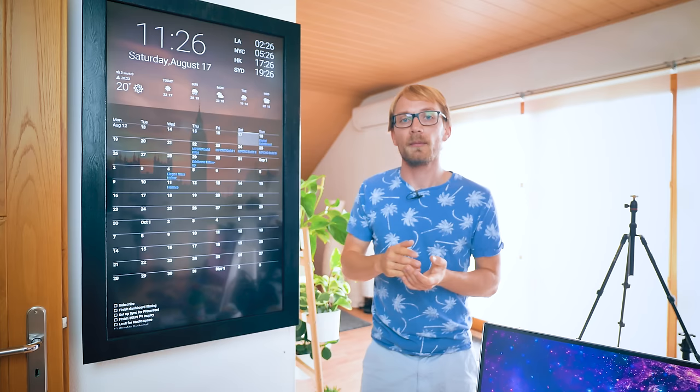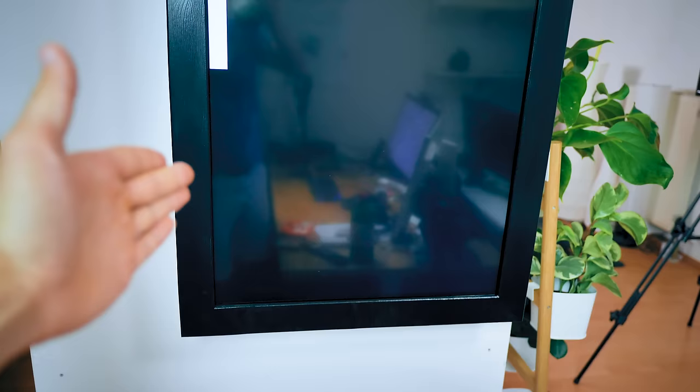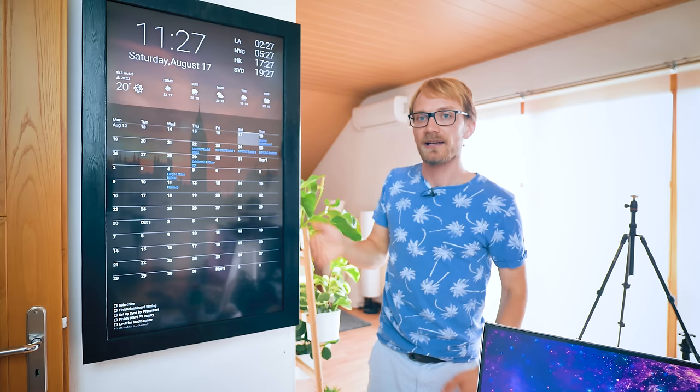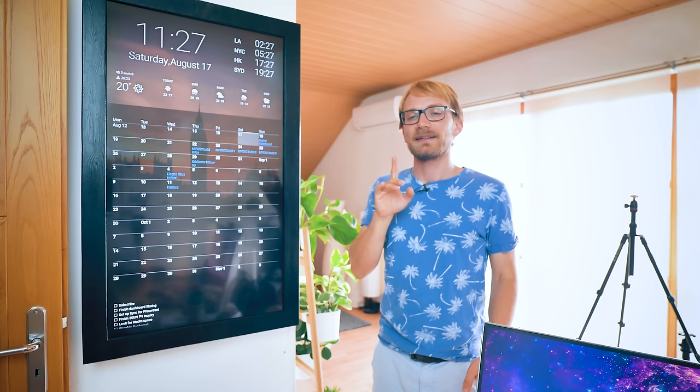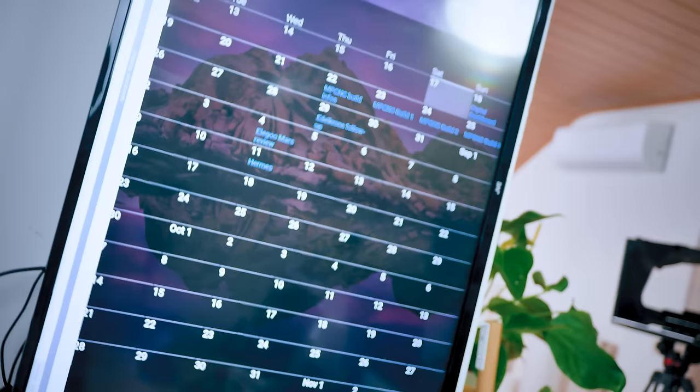But there's still the issue that this screen is rotated. Normally you can easily configure the entire HDMI output to be rotated with the boot config, but with a 4K screen the entire image would get shifted off to the side so that most of it is black and you're only seeing a small slit of the actual image. So instead, I tried a few Chrome plugins that would rotate just the website. PageRotate did exactly what I needed, but you need to click it every time, which doesn't work here. So I looked at what it did to the actual web page and replicated that — essentially it creates an iframe, which is a virtual browser window within the actual browser window, and then rotates that entirely. Works beautifully.